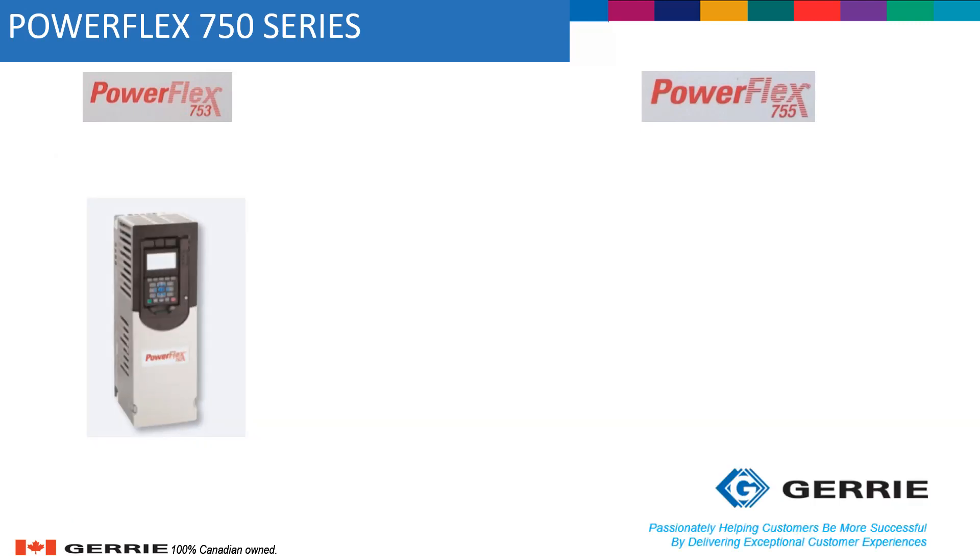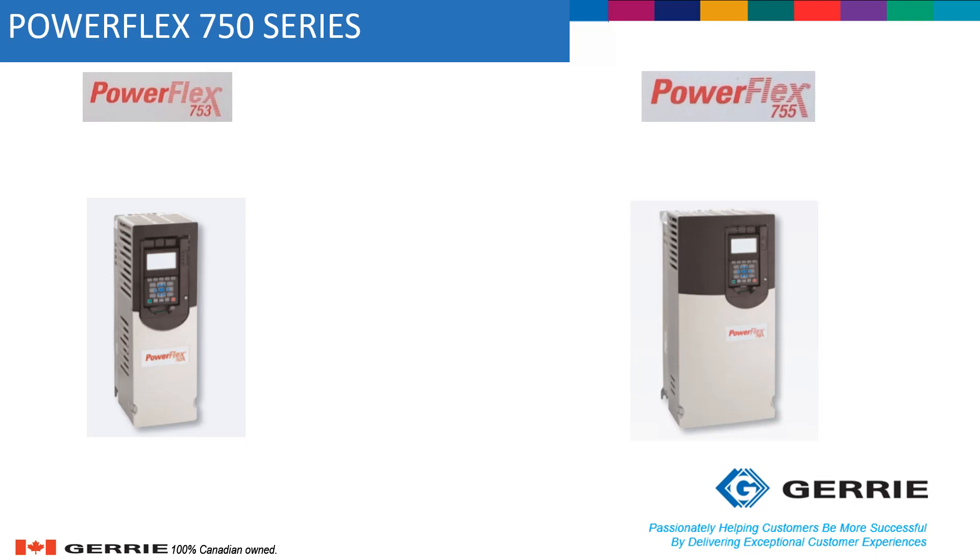In conclusion, the PowerFlex 753 drives are cost effective and very easy to use for more general-purpose applications. They feature standard built-in I/Os plus three option slots for communication, safety, and additional I/Os. The PowerFlex 755 AC drives are very easy to use, offer application flexibility and high performance, include multiple control hardware and safety options, and are well suited for a wide variety of applications with multiple motor control selections. The built-in EtherNet/IP delivers real-time operating data, easily integrates with Logix control systems, and is ideal for applications requiring position, speed, or torque control up to 2000 horsepower.